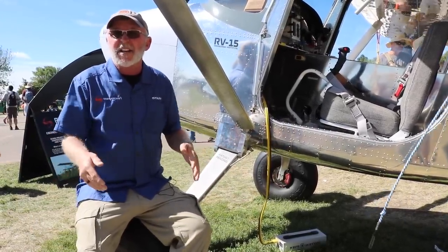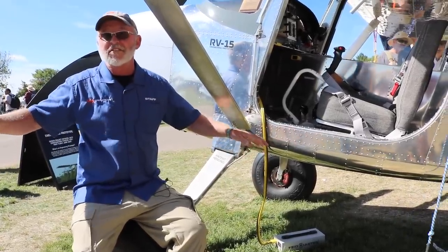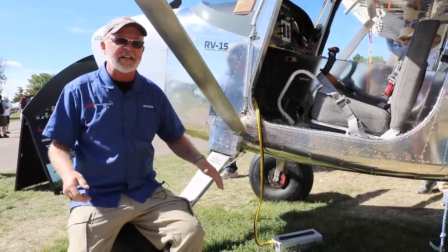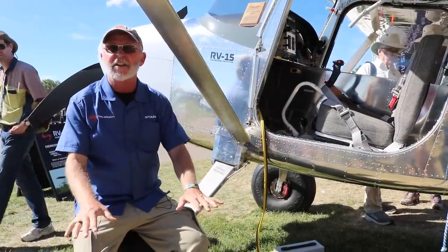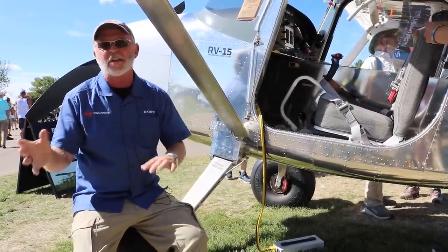So with spring gear, right, you get the dampening coming in, and then you know, especially if you watch them in slow motion, you can see them. The airplane comes off the ground and it does this, right? It throws you off the ground, springing. This is different. It's gonna come down, and then nice and easy, it comes back out, allows you to stay on the ground, avoid the bounce, allows you to get in shorter, you don't go flying again.